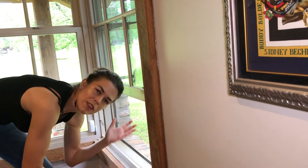Enjoy the fresh air! It's amazing to me how many things seem like they should be big scary fixes and they're really not. Having a window sash that wants to fall seems like it should be really hard to fix, but it is typically one of those two things: either your tilt pin has slipped out of your balance shoe — so you've got one shoe way up here and one down here — or there's something wrong with your tilt pins themselves. Different manufacturers call these parts different things, but the premise is the same.